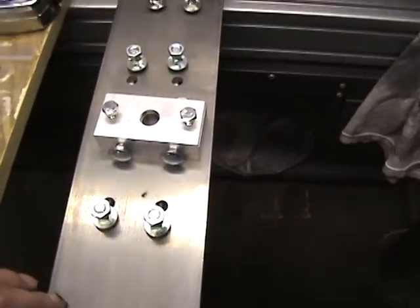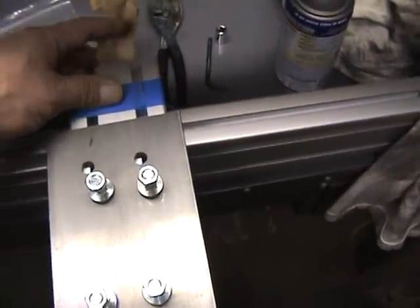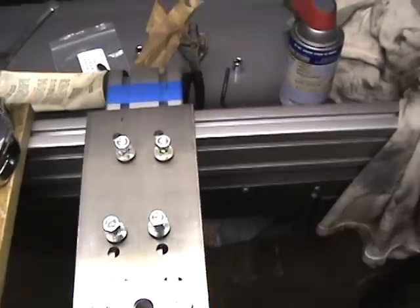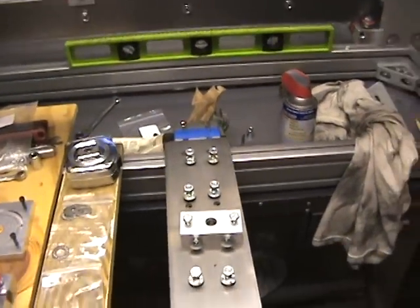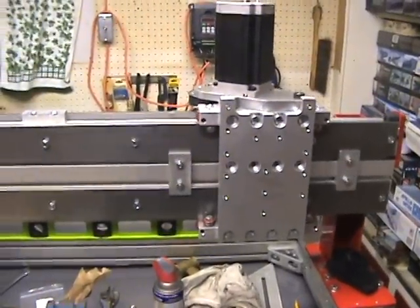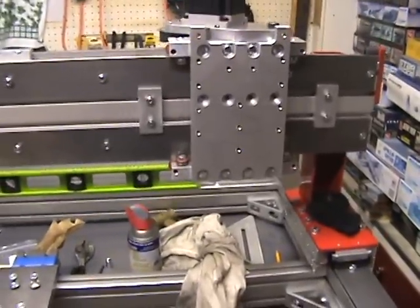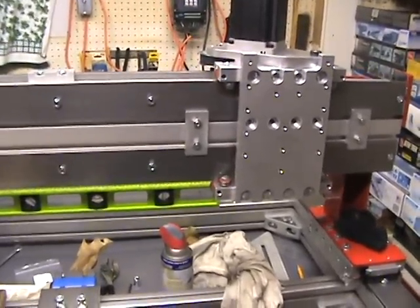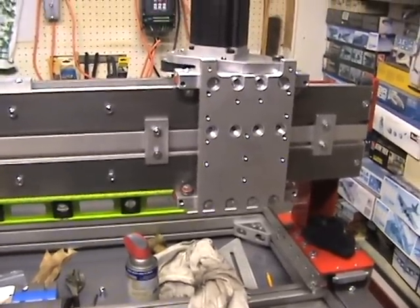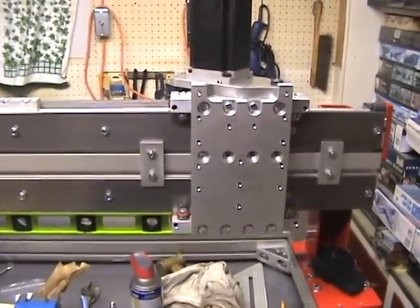The bearing is inside. The other thing with the aluminum extrusion here — your lead screw may wrap and sit down inside; it's taped so it doesn't fall out. So that comes well packaged and well covered, no issues with the lead screw. At this point the Y-axis is basically done and I'm ready to start assembling the Z-axis. After I get that done I'll review it. The last thing to assemble is the X-axis gear racks and rack and pinion system, and when I do that I'll review how the rack and pinion system goes together. Thanks for watching.